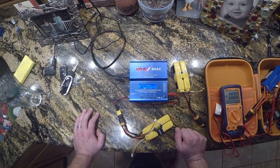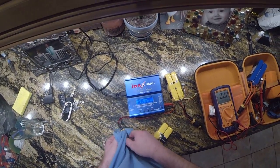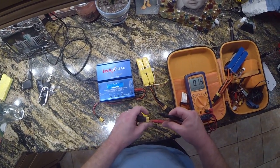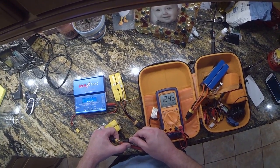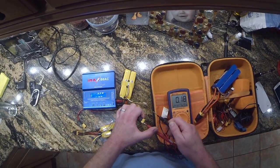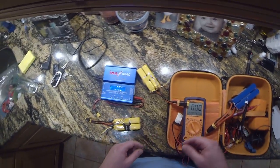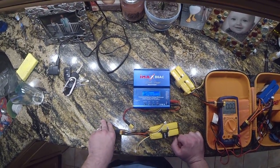And that's about it, guys. This is a pretty quick, easy way to calibrate your IMAX B6 or B6AC, genuine or knockoff. Once again, this is the voltage that was charged before calibration — it already went up some even with that little tiny charge. And this is the voltage after calibration; it was actually 12.6 a little while ago. So that's pretty nice. Subscribe if you haven't, and take care. Happy new year — I'll see you around.